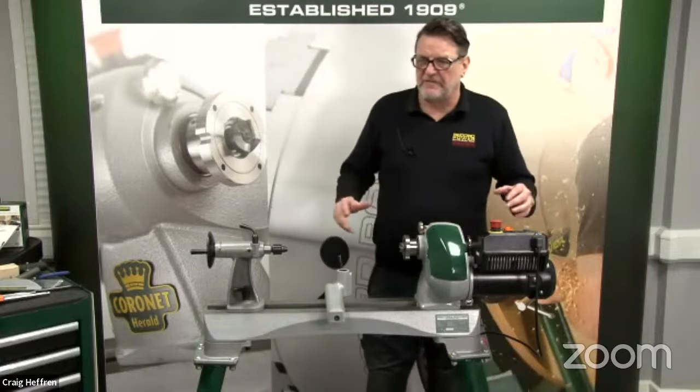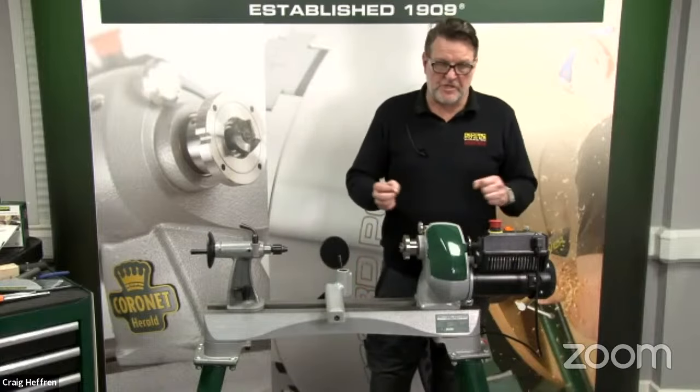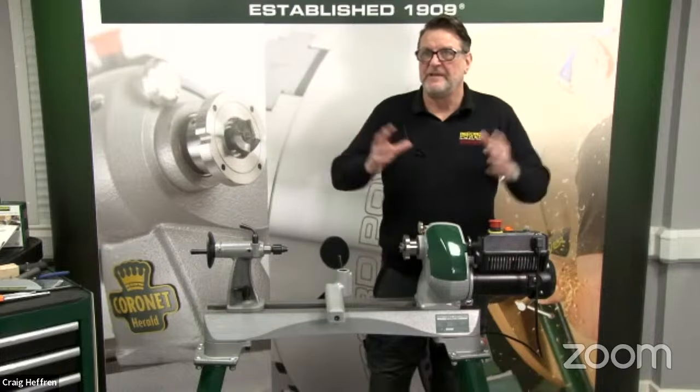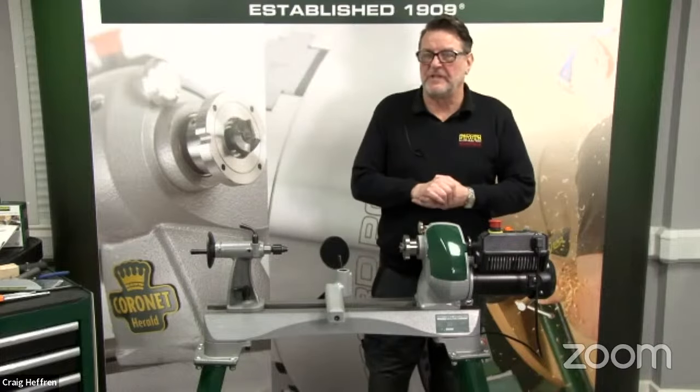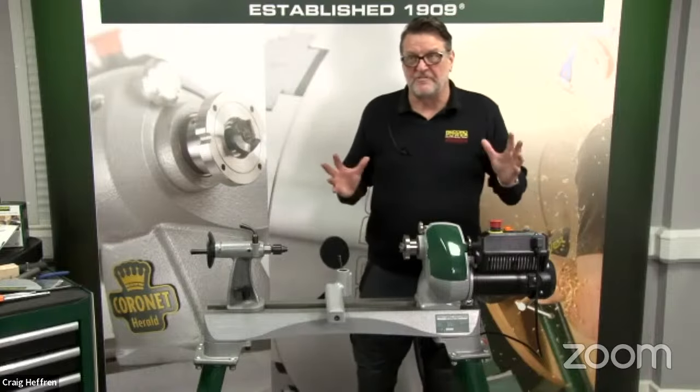The only thing I've got to be careful of is obviously they run off the air, and you've got to have a non-return valve on so you don't lose the pressure and things like that. If you get the electrics going on your lathe or in your workshop, and you've just got that suction going on, no non-returns, it's going to drop off. There's some very good ones about.